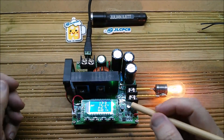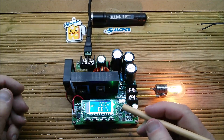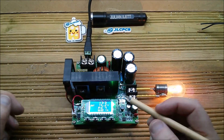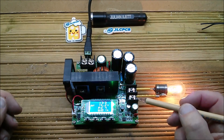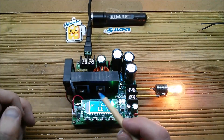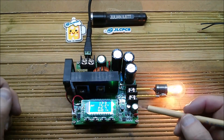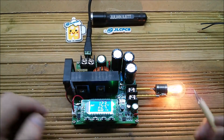At the moment it's showing a ridiculously bright green CV light, which is a bit strange. I would have thought when this thing is not boosting, that should really be off — because all we've got on the output is the voltage coming in on the input minus the diode drop. That's a bit odd, but it does come on.